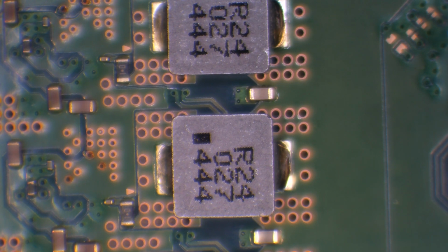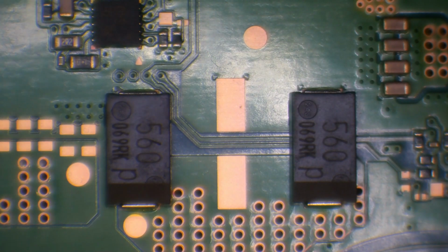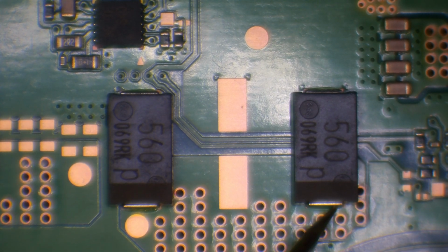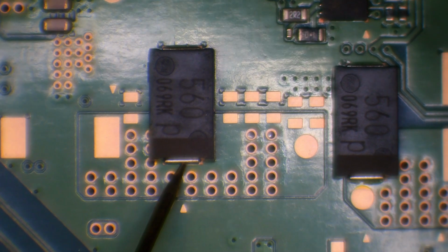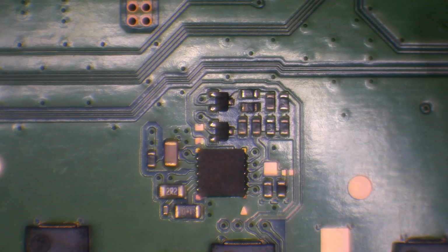Which is gonna suck. I can't test anything around there. There's not really a lot I can check around the APU. It's all gonna show up as low impedance. These caps here are showing up as 0.15, 0.15 volts on diode mode on the donor board. Yep, same as that. And that one's good. And that one was showing up as 0.02. Yeah. There's not really a whole lot I can test. In terms of power, there's not really a fat lot that I can do.